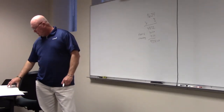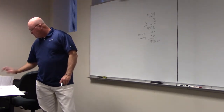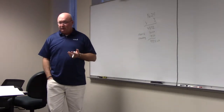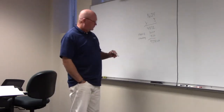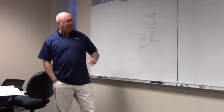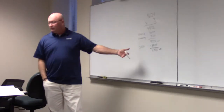Good? We good? All right, now we have to go back to section 220 in our code book. And on page 70, if you got a 2014 code book, it's Table 220.42. Table 220.42 says the first 3,000 VA on a house is how much percent? 100. So we're going to pull that out. That's 3,000. We're going to take 3,000 from this then, because we already got that at 100%. So now we got 6,372 VA left after we did this at 100. We just kind of pulled it out.